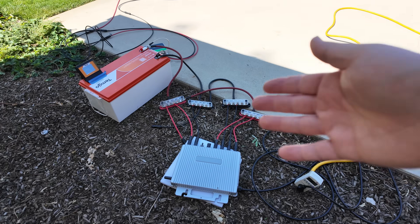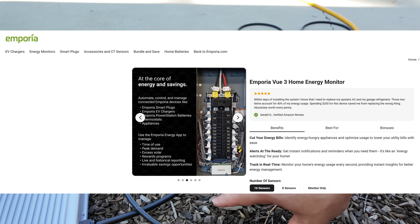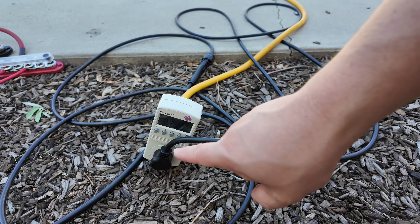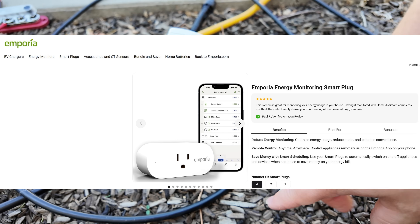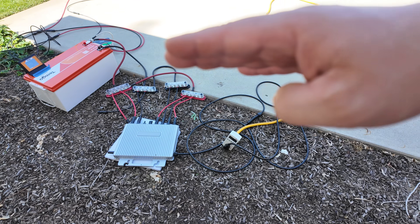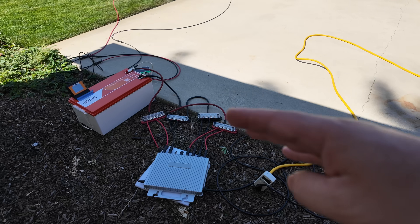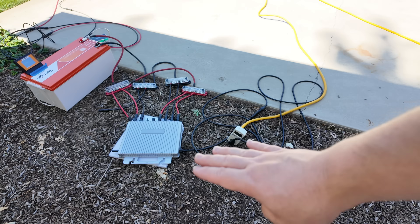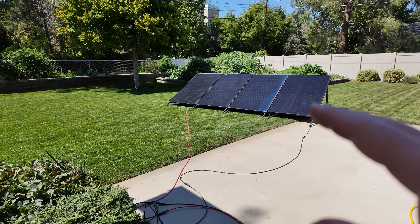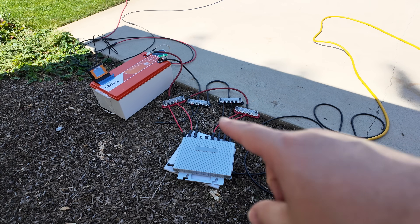Isn't this so sweet? We're talking major power offsets because we're running day and night. Consider this one more thought: get an Emporia power monitoring system — I'll leave a link in the description. It goes in your breaker panel and monitors power consumption in your house. You can then use one of their smart plugs that plugs into 120 volt power — put that on your solar inverter output and program it so that it turns on only when a certain threshold of power consumption is met in your breaker panel. That way your inverter only turns on when your house is consuming more than 1000 watts, and when your house is consuming less, the smart switch automatically turns off. That way you're not wasting power sending free power back to the grid. If you have your battery array, you'll still be taking advantage of the sun while it shines. That could be a potential way to really maximize your savings with the system.